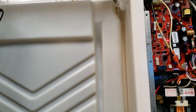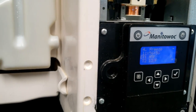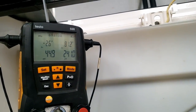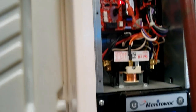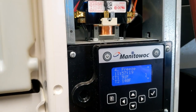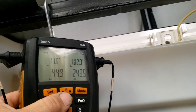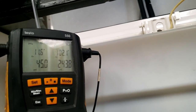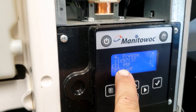Our liquid temperature is at 97, which is a lot better than 113 — that may change a little bit as we start running. We're going to check our pressures while we're at it because it felt a little bit cool up there for a hot day. There's our pressures — we're into the freeze. Start our stopwatch, we're going to watch that for five minutes. Looking at it makes me wonder with the head pressure control on there. Let's put that on the right reference: 102, a little better. We've got 95 degree liquid — minus 101 — I'm just going to watch it.